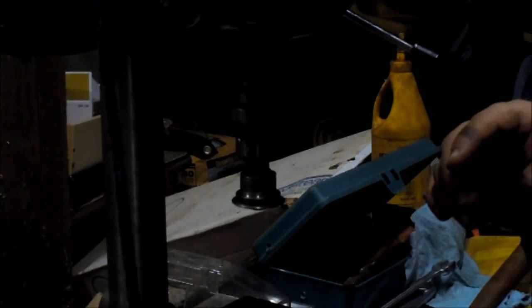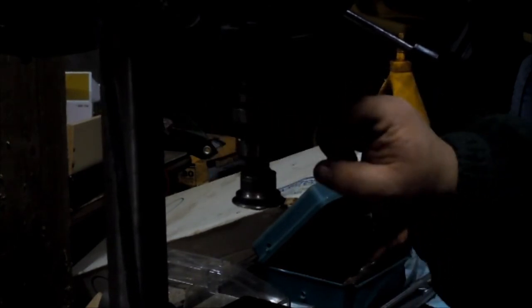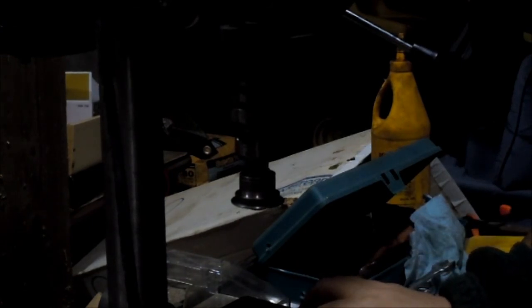And since you're pulling down on this, when you're pushing down, it can start moving the drill press arbor, and you don't want to push in and out, because this chuck is just press fit up on here. When you get them, you just put this table all the way up and crank on this as hard as you can, and just shove it on there. There are no set screws or anything. It ain't a mill, so you really have to go slow. But this is a lot faster than doing it totally by hand. I mean, yes, it's still by hand, it's filing.